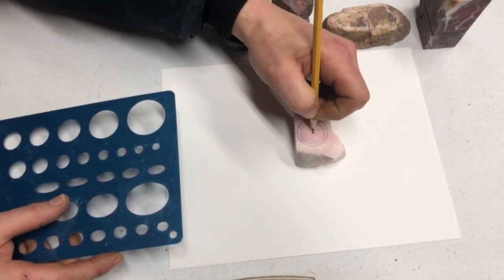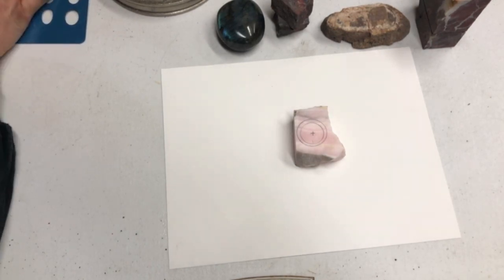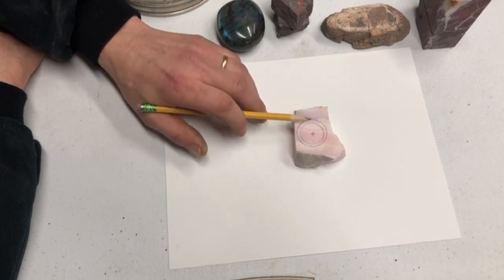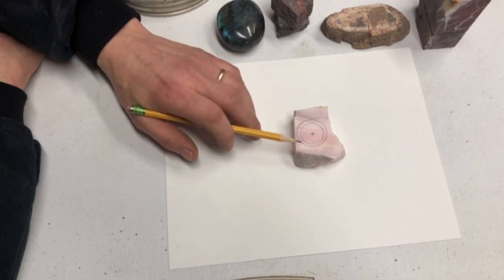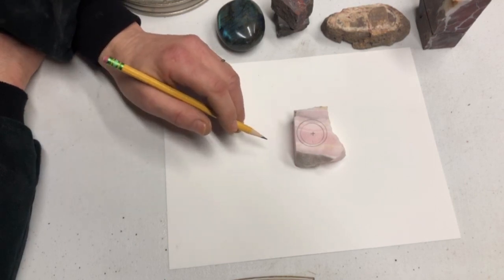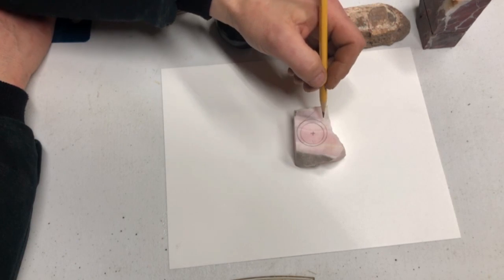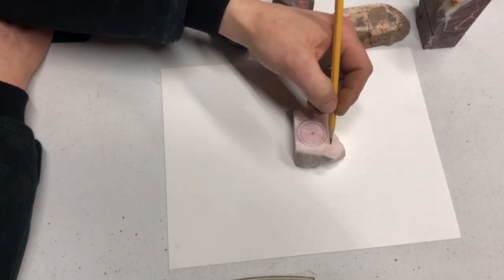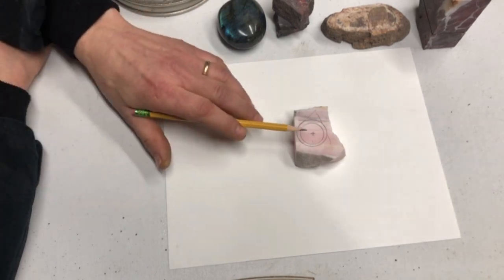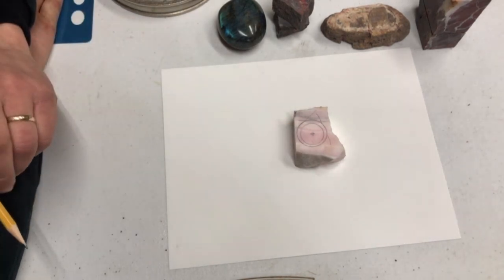you would mark the center of your workpiece. And in my case, I tend not to bust out the ruler. I tend to mark close to center and then let the slop take care of the amount that I might be off center. At this point, you would take it down to the PT8 trim saw, which is what I use, and then you would start cutting away on your form. Once you've done that, then you can take your piece of stock and install it in the phenolic pins, making sure that your X is in the center.